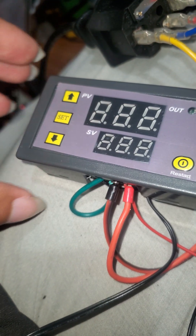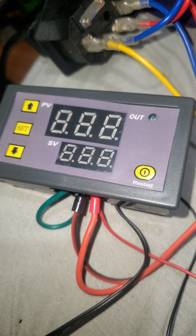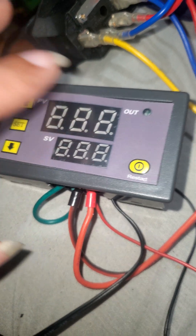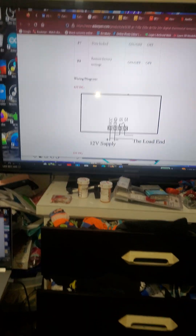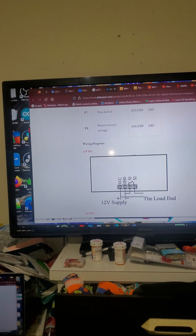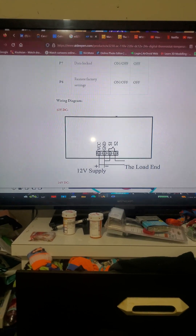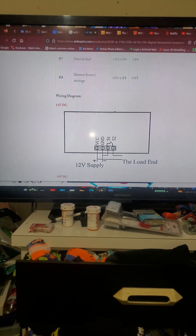What I wanted to show you in this video is that when I bought this it didn't have any wiring diagram or schematic on how to set it up. So I Googled it and looked up a wiring diagram for this actual controller. So that's what it looks like — that's the back wiring diagram for the W3230 thermostat controller, and you can see down here at the bottom the S1 is the negative that goes over to the load or the power that you're trying to turn on.